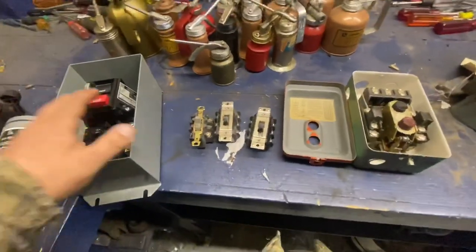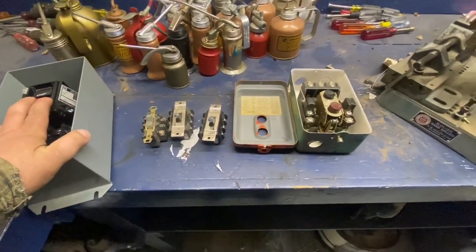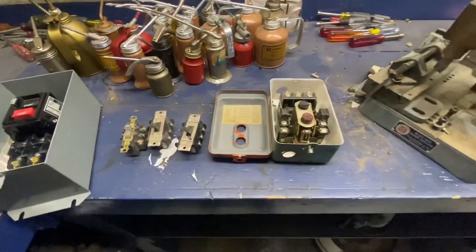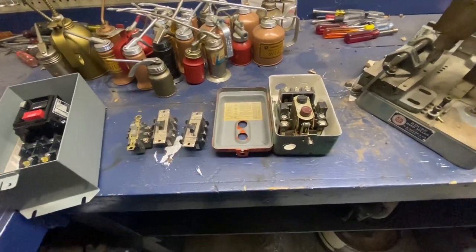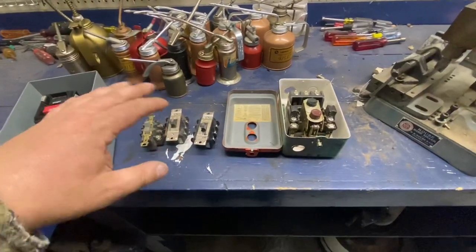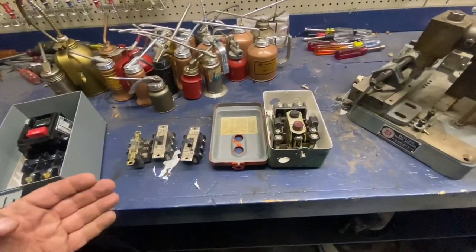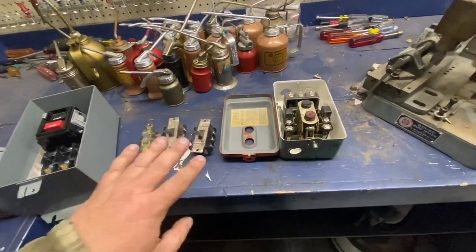Now in my videos I started it with an electrical disconnect. It works, but that's not a proper way to do it — that was just for demonstration. If you keep using a service disconnect switch like that you'll get arc burns, especially on higher horsepower or higher draw motors. They're not meant to turn something on and off; they're to break the power so you can safely work on equipment.